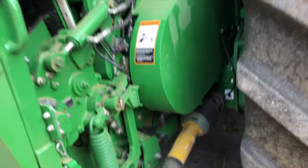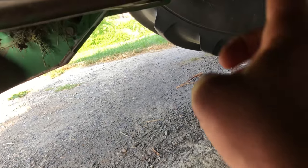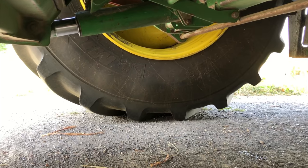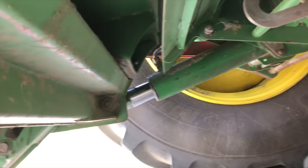All right, these guys have got this thing all full of fuel. We're gonna roll in underneath it. And I think we're gonna have to shim up this spiral band right there. So we got to pull this transition chute down, scrape it off, and then we'll see if that has the appropriate amount of shimming in there.